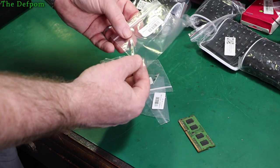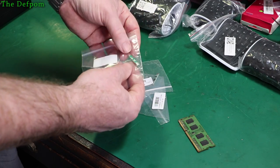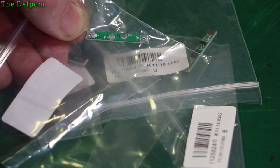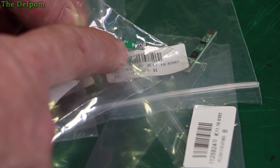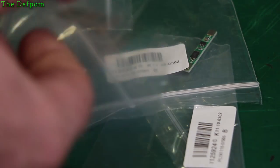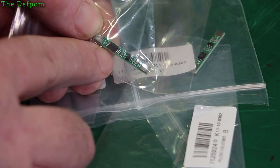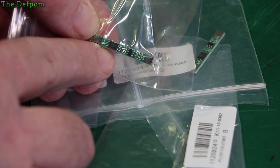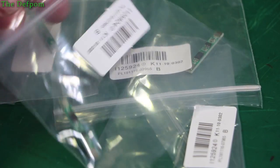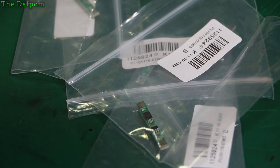So these are some BMS modules. Battery minus, power minus, power positive, battery positive. The battery positive and power positive are linked together, and the negatives are separated, which is quite common because you use negative switching on the MOSFET. It's a single cell, which is fine — sometimes you just want a single cell protected. I got some of these thinking I might need them; turns out I don't. Links down below.